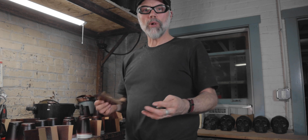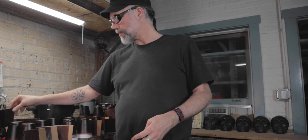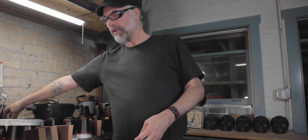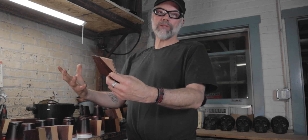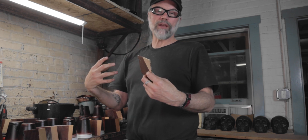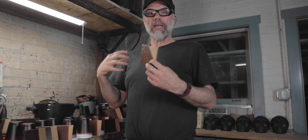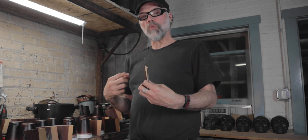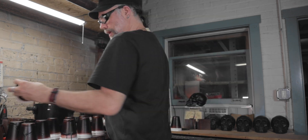There are a variety of ways you can do your pour cups — you can start with a plaster or rubber mold and make wax cups, or some people use paper cups dipped in wax. I prefer styrofoam because it burns out a lot faster. When we stick investments into the burnout kiln, we want the cup to evacuate before the gate system and ultimately the pattern. As wax heats up it expands and can potentially crack your shell, so the faster we get wax out of the investment the better. Styrofoam has the ability to vaporize very quickly.